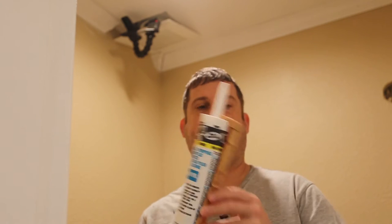Today I'm going to shoot a short video on caulking the crown molding and show my technique. I've got a GoPro up there so I can get some close-up shots of what I'm actually doing. I'm using a 40-year rated DAP Alex caulk — I buy it by the case at Home Depot, it's about two something a tube. I've had pretty good luck with this. The first step is to caulk all the joints, and then the second step is to come back and smooth it out with your finger in a glove.